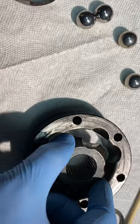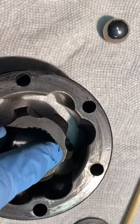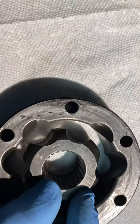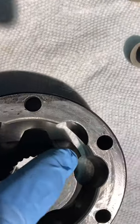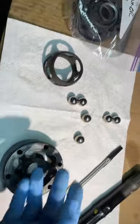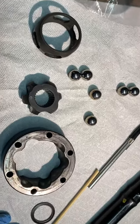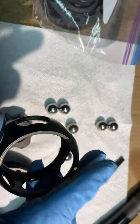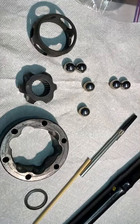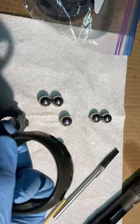There's one last thing. When you assemble this, you have to make sure that the small matches the large and the large matches the small — fat circumference here and thin there. It's got to be like that, because if you put it in the wrong way the sucker will lock up. Then you just push the balls in, line that up, turn it and angle it — that's the easy part. The part that was really pulling my leg was the thin bevel versus the flat bevel. I finally did a bunch of research and confirmed the thinner-looking side goes towards the shaft.